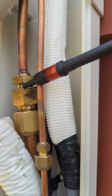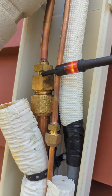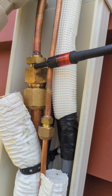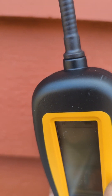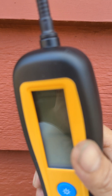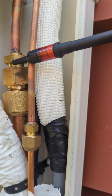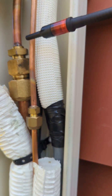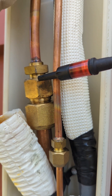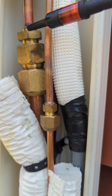See, it goes crazy. A lot of times the reason for that is there's no adapter — the copper ring — between this fitting and that fitting. You cannot just have brass to brass; you've got to have a copper piece in between, and that will be your sealant. So this is our leak right here.